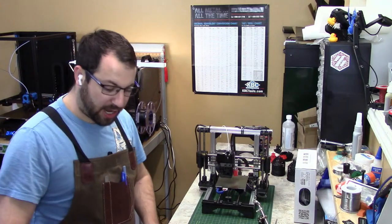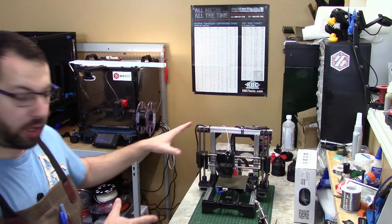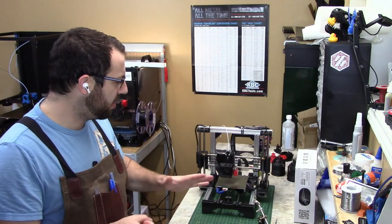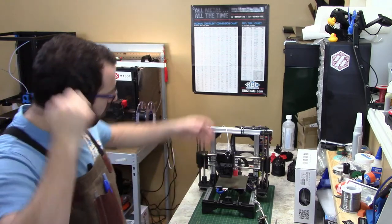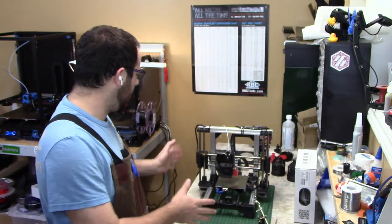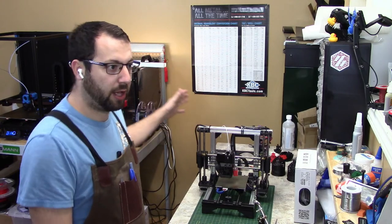So anyways, bonsai time. So, bit of an update. I do have Fluidd working on it. I want to thank Cadriel, I'm hoping I'm pronouncing it right. We did a little bit of testing. Turns out it was a somewhat simple yet not simple issue related to the fact I'm over UART and I had to enable something that wasn't enabled. But we do have it working now with Fluidd. It's off right now because we know the fan is annoying as hell.